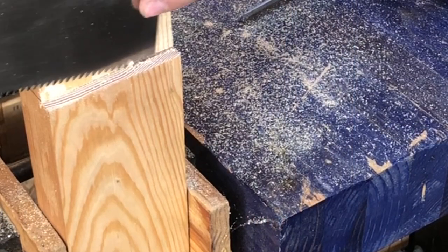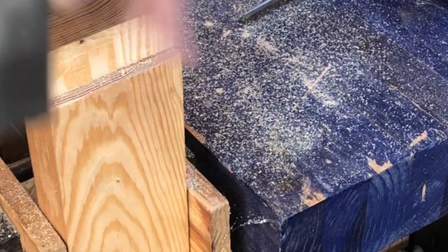On the other side — the tip of the saw — there's another special tooth I call the first tooth or the front tooth. This one is for when you're cutting tenons or dados: you can lift up the saw blade and slice those last few fibers to get the bottom nice and straight. Because the saw naturally tapers, you tend to overcut your line a little bit; this way you can lift up your back end and slice those last few fibers with that front tooth and give yourself a nice flat bottom.